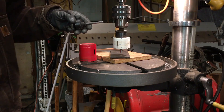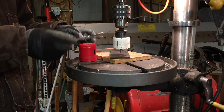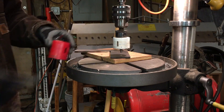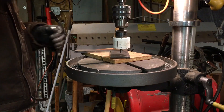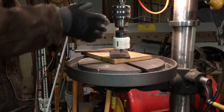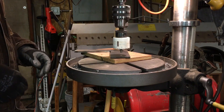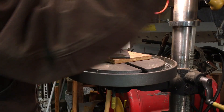So that's what I always do — I almost never actually use the quarter-inch drill bit in my hole saw assembly. I'll just chuck the quarter-inch drill bit into the drill separately, drill out the center hole where I want it. In this case, I already pre-drilled a hole right here. Then I chuck my hole saw into the drill with that quarter-inch rod loaded in place of the drill bit. Now I'm set to drill the hole — that rod will guide me and keep me centered, but if it bends, no worries. I just pull it out, bend it straight again, put it back in, and I'm back in business.